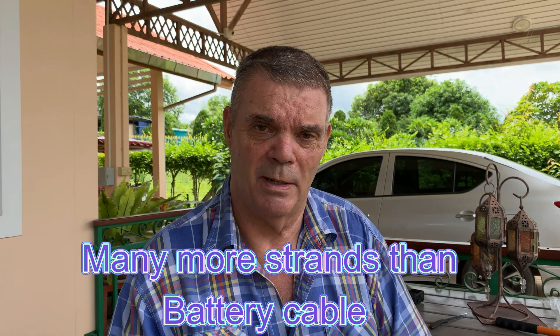If you look at that — this is the battery cable and that's the welding cable — both are 50 square millimeters, but the welding cable doesn't look as thick and chunky. It's got maybe a bit thicker insulation but looks much more of a chunky cable overall. I've taken the heat shrink off to have a look at the connection and that appears to be a really good connection. But I wanted to make my cables bend and look neat, rather than buy pre-made cables that might be longer than I need. I bought five meters of this welding cable and it's very very flexible.